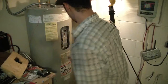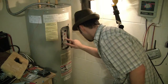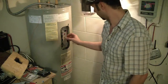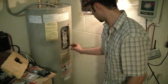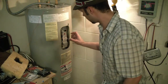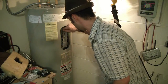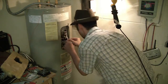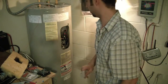Here's the top control that I was telling you guys about. It's got a little thermostat and it goes from A, B, and C — it says very hot, so you've got hot to very hot. Right now this is a little bit more than in the middle, and for us it's 120 degrees. This was original with the house, so this is going on about eight years old. What I'm actually pulling this off for is the electric feeds down into here, and I want to make sure that me shutting that breaker off means the electric is actually off and they didn't mislabel one of the breakers — because that could be pretty messy. So I'm going to get a voltmeter and touch it to that and make sure we don't have any current.